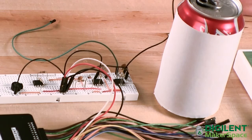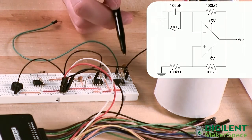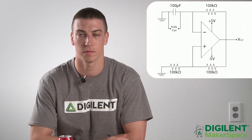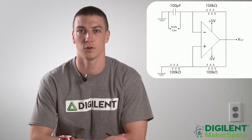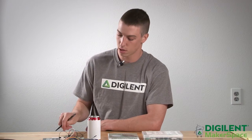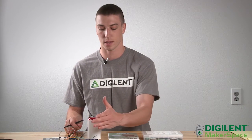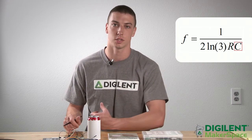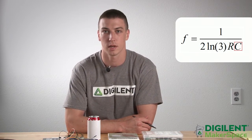This circuit begins with a variable frequency oscillator, which is right here. This is composed of the OP27 operational amplifier, three 100 kilohm resistors, and a 100 picofarad capacitor. That capacitor is in parallel with a capacitor composed of myself and the soda can. By holding this wire right here, I make myself one plate of a capacitor, and the soda can is the other plate. By moving my hand closer to or further from the soda can, I can produce a change in capacitance, which changes the frequency based on an equation that governs the output of this variable frequency oscillator.